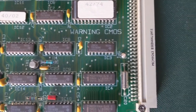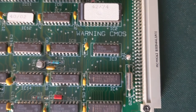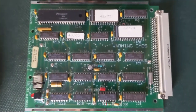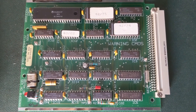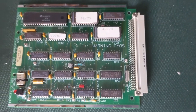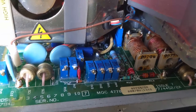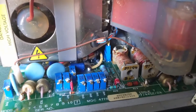The output of this thing obviously isn't composite video. There's a test point there — it could be. The trouble is you can't get access to the circuit board whilst it's operating to measure the waveforms. It's interesting — it's 15625 Hz scan rate, which is the same as European TV scan rates. It's a monochrome display. As for this CRT board, there's no indication on there what sort of video interface it uses. I was going to pull it all apart, but I don't think I'll go that far. This is really just a quick video, but I think this device is going straight back on eBay.